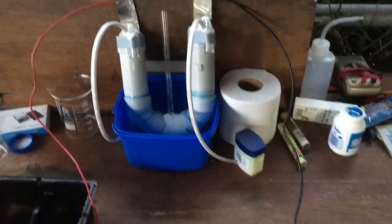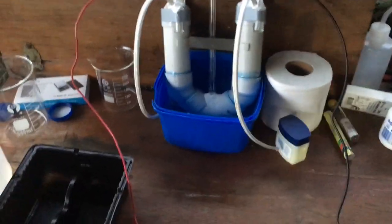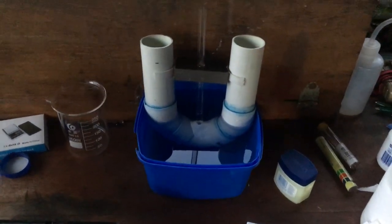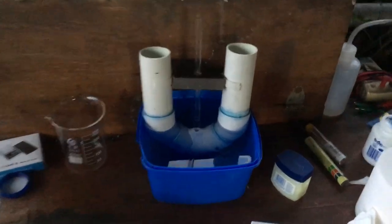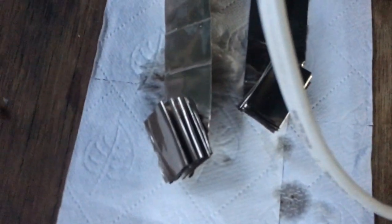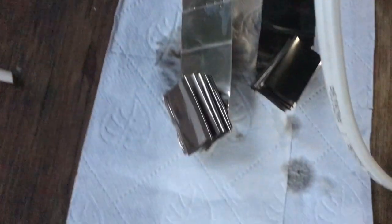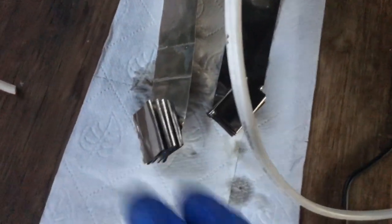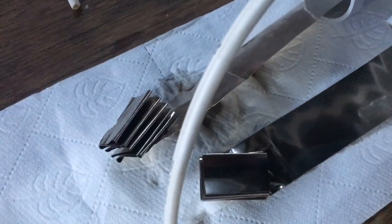While we didn't make it with solar power, we could have and that's all that matters. The only thing left to check is the condition of the electrodes after the cell ran for 12 to 14 hours total — and having a look at them, they look perfectly fine. Especially the anode: I expected some discoloration, maybe a thin oxide layer on the nickel, but there's absolutely nothing. Those little lines are just folds in the strip that were there before — looking exactly brand new, same for the cathode, but we expected that.